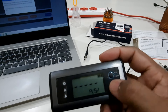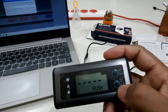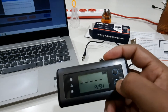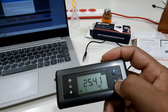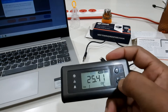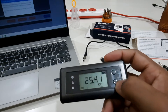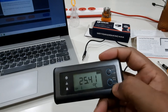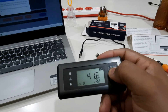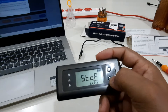So this is how you start the logging — set it at 10 minutes and every 10 minutes it will record one data point. If you push the button again it will start logging, showing minimum temperature and maximum temperature. Pressing the top button shows the range, and the second button asks if you want to stop logging — press below to confirm.